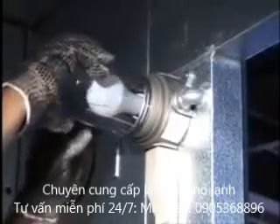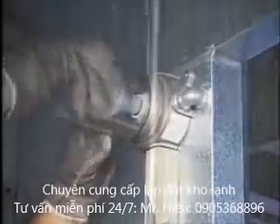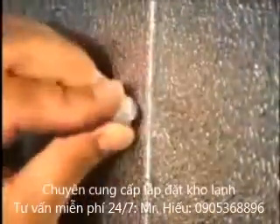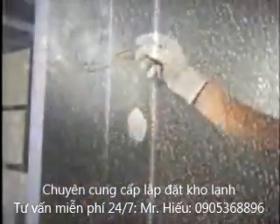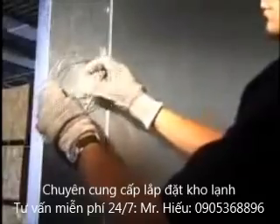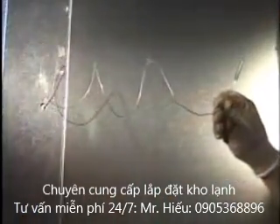The power should be hooked up by a certified electrician. Insert the cam hole plugs by gently tapping into place. Uncoil the thermometer and attach it to the wall in direct air flow from the coil. Remove the plastic covering from the floor.